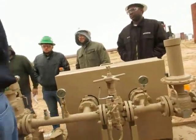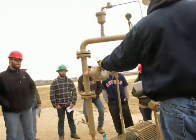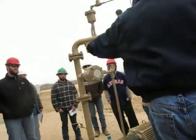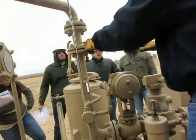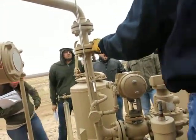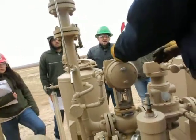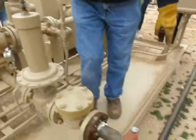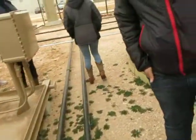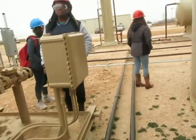Yeah, so here's what we do now. It went past here and said, look, bad oil coming. Bad oil's coming. Gets to the sampler and says, don't take a sample. Don't want that in the sample pot for the pipeline company to check. Got bad oil, so when it gets to this valve, it turns and diverts the flow this way, and there's a line going back to where? Where's it go, Stephanie?